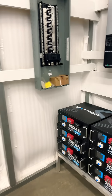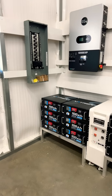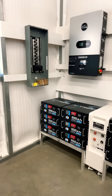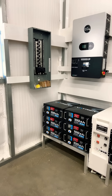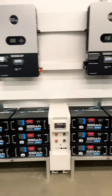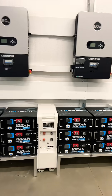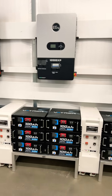I'm using a manual transfer switch, and it's actually sitting right here. The manual transfer switch is going to have a fuse inside of it — G-class fuses on both hots — and that should definitely give me some extra protection. I have some other things on the way to up my safety even more.